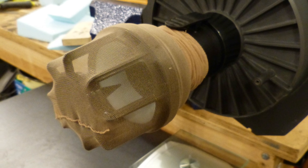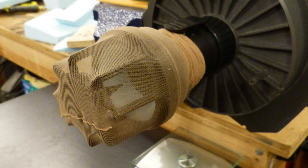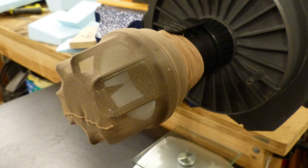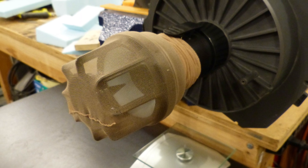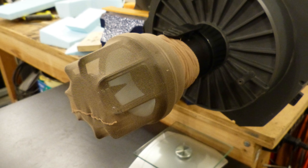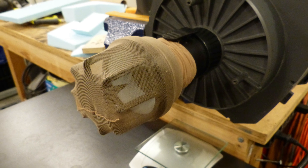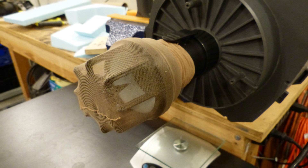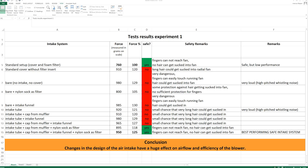The safe solution combines the tube and cap from the muffler normally used on the exhaust side of the motor in shop vac mode. I removed the foam insert, installed the insulation foam funnel to smooth the sharp edges, and used a nylon sock to make absolutely sure that not even the longest hair can reach the impeller. With this intake setup, the blower motor pushed 950 gram-force — still a full 25% more than the original setup and only 5% less than the strongest but unsafe intake. Here is a table of the test results; just use the pause button to take a closer look.